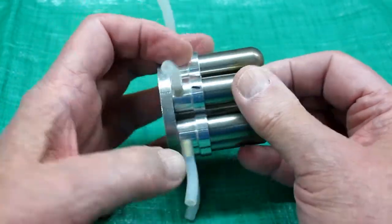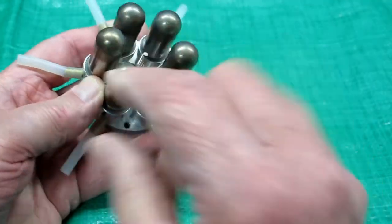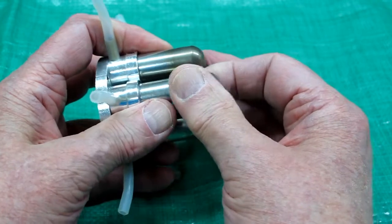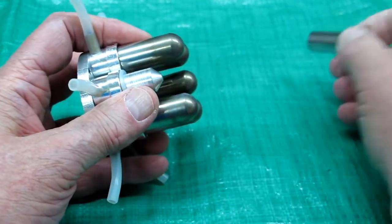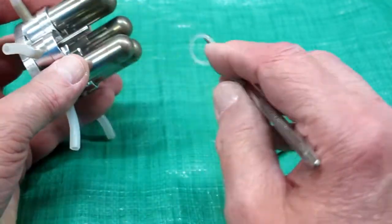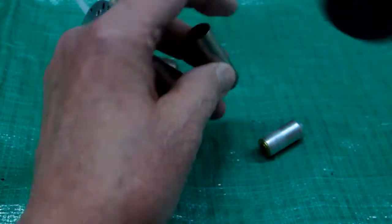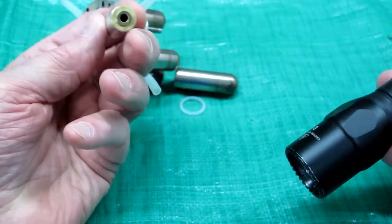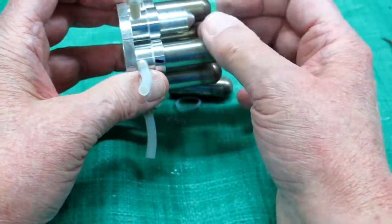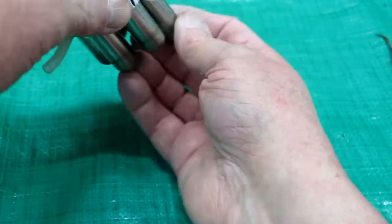To my knowledge, nobody's shown one of these apart before. You wiggle it, and I can see there's a silicone O-ring in there. I'm going to make a wild guess that that's the same size O-ring as what's on the cylinder head. And that is a displacer. Inside of the tube looks perfectly clean. And this is the displacer — it slides back and forth. We can hear it hit on this end, but more than likely we're hearing it hit on the other end.